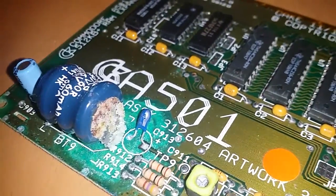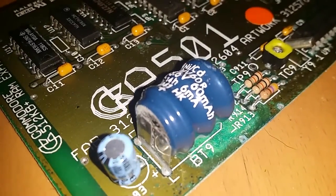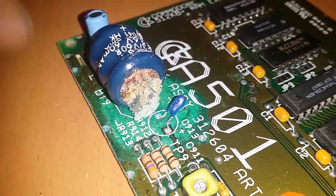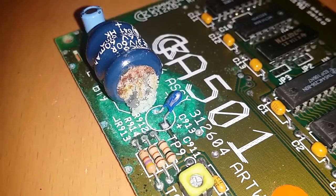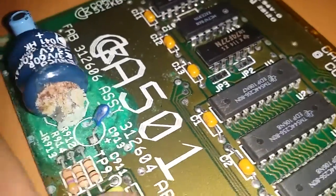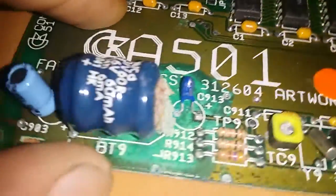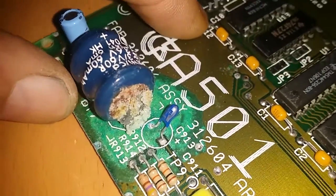To the solder mask anyway — I don't know how deep it is, I've only just opened it. These things are soldered together so I had to unsolder the two halves of the shield to get it open. It all seems to be leaking from one end of the battery. I'm going to have to desolder this and clean the whole board — make sure there's no damage to any traces or anything.